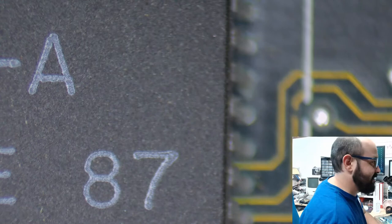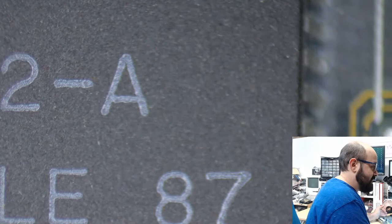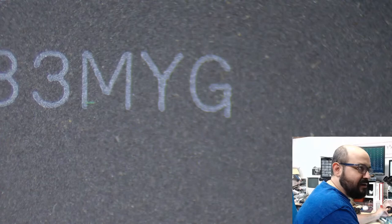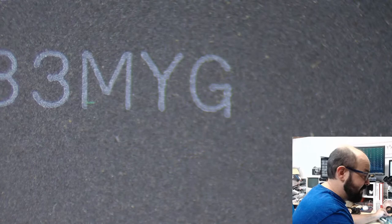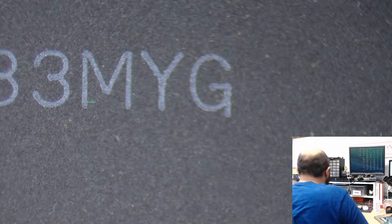Sorry. The SE/30 is on hold. Thanks to my friend Bruce at Brankus Creations, who pointed out that of the two chips I was having trouble with, at least one, when I removed it, I saw some corrosion under it, and the chip leg fell off. I thought, oh great, I'm going to have to solder this back on. Then Bruce told me they sell those for a dollar or so. So I did a Mouser order of those chips. I should get them shipped to me in a few days, by the end of the week. So maybe on Friday we'll do an SE/30 stream. But find a better place for this keyboard. Just put it there for now.